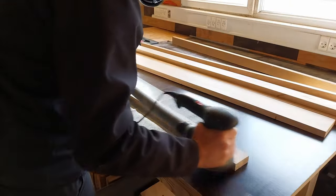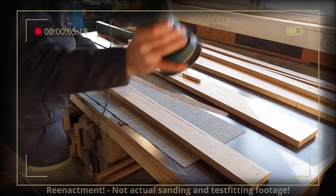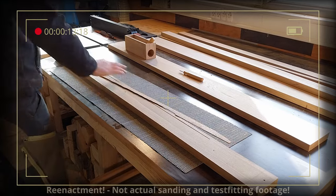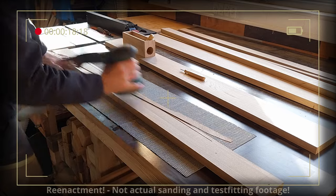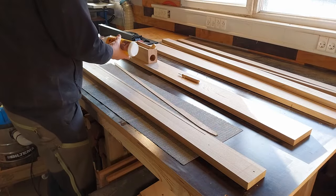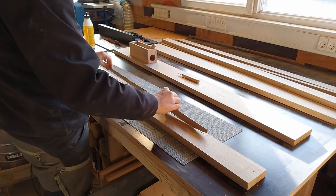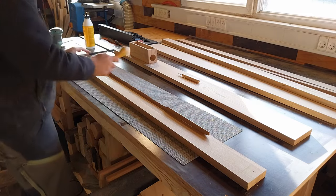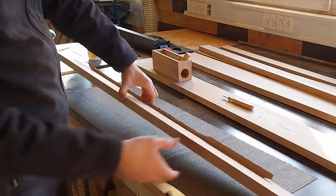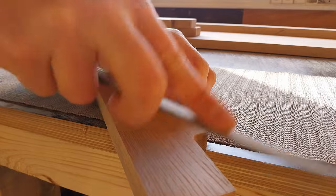Here I'm trying to show that I had a thin strip of oak from earlier that I sanded to size so it would fit a tension gap that was in one of the boards when it was a table. After overly dramatizing the sanding, I filled the hole with glue and tapped the strip in with a pestle from a mortar set — those kind of tools are also welcome in my workshop. Then I let it dry, and used some files to soften the edges of the legs before calling it a day.